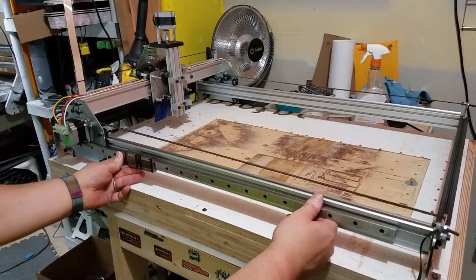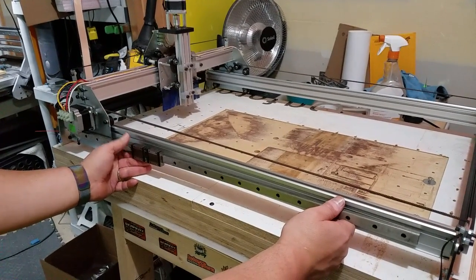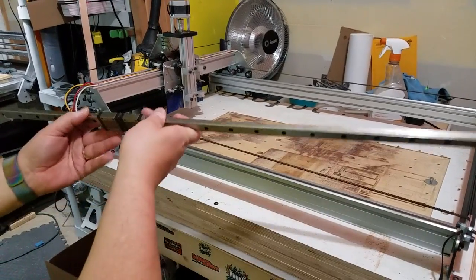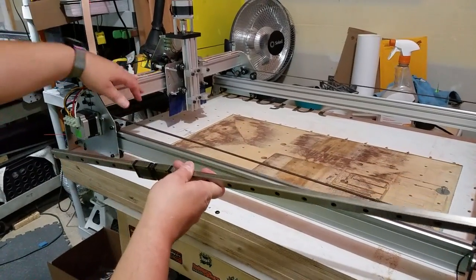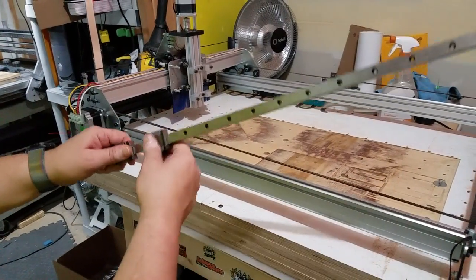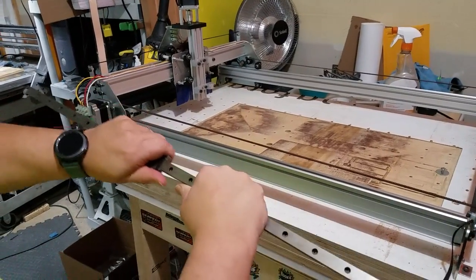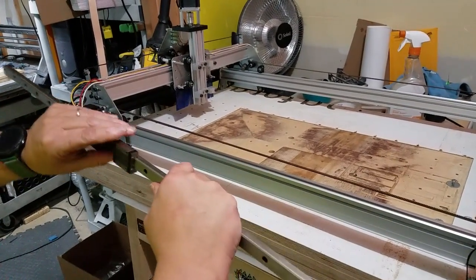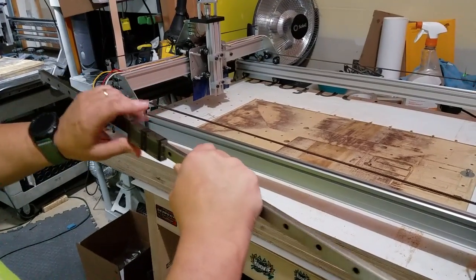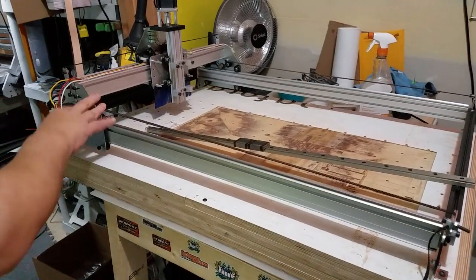So I purchased these Japan rail carriages and that's how I'm gonna mount them. This is video two, showing the concept — I'll do a couple of videos before actually getting them mounted, because I need to redesign the plate first. I'll do a step-by-step and then run tests with the belts to make sure they can handle dragging these slides. There's a little resistance on them right now, but they're dirty from the factory — they keep them greased to prevent rust.